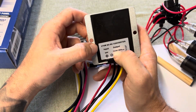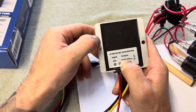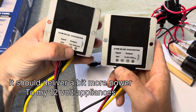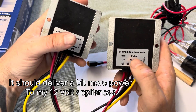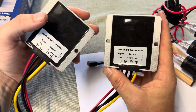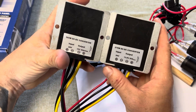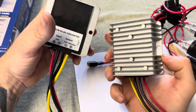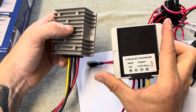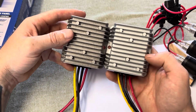I've recently picked up a similar unit — a new one I got the other day. This one has a 13.8 volt output, so it's going to be a little bit more efficient on the output side. It puts out just above 12 volts, giving you an extra 1.8 volts. It is said that the slightly higher voltage will run your 12 volt appliances a little more efficiently. I'll probably do a side-by-side test comparison later on. This one was only about four or five dollars more expensive — be interesting to see how much of a difference there is between the two.